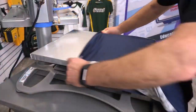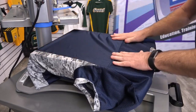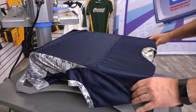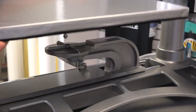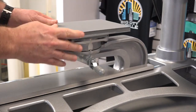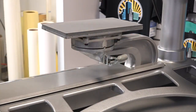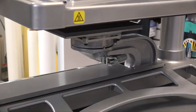Built-in threadability allows you to easily load a shirt by opening it and sliding it over the lower platen, so that you're working with one layer of fabric. The lower platen also features a quick-change latch, providing you with the ability to easily change the 16 by 20 platen to one best suited for the item being pressed, eliminating potential pressure issues caused by raised areas like seams and buttons.